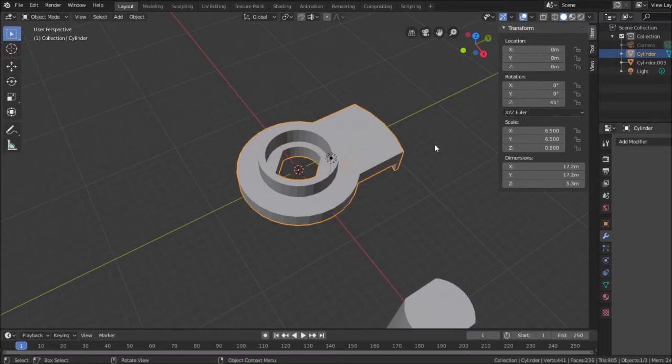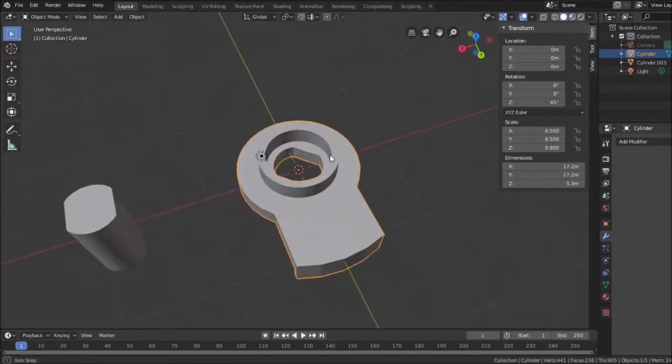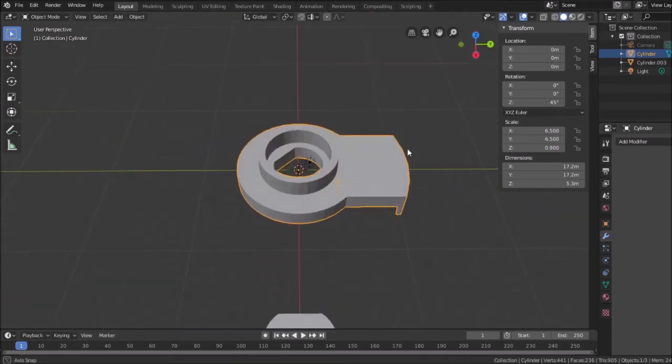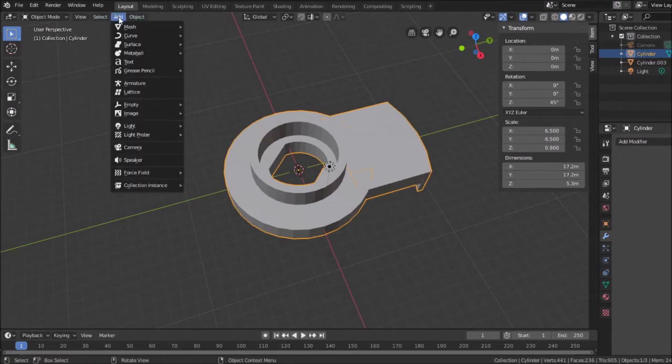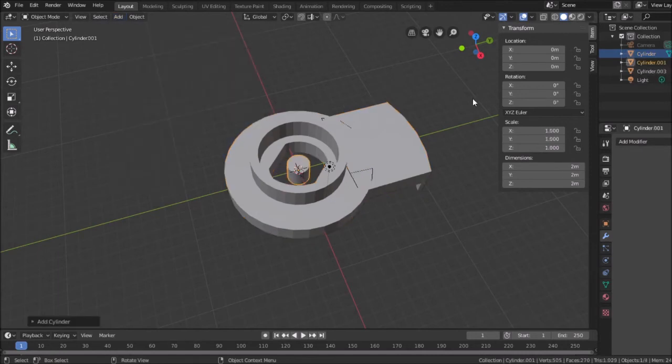Okay, so it's starting to come together here. Now, the next step would be our support pins for the metal sweep. And I said those were 1.2 millimeters wide, or in diameter. So let's start by adding those. We'll add a cylinder that is 1.2. And I'm going to give this some serious height. We'll do 5. There we go. So that's the center of our pins there at 0, 0, 0.